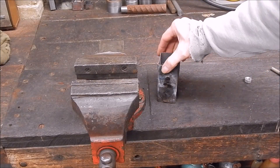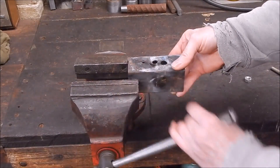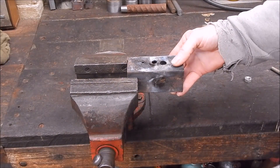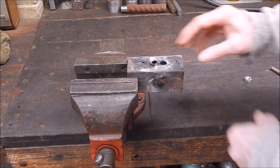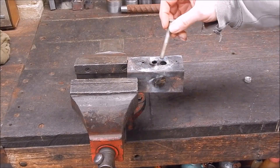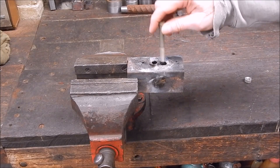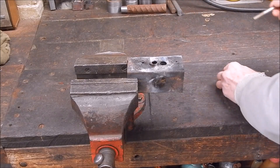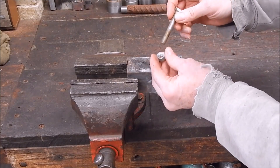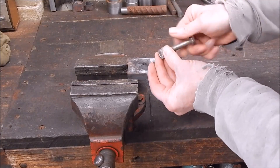When you do this sort of work you've got to conserve your heat energy as much as possible, so you isolate your work from any heat sink situations. I've just got a bit of old scrap - you can see it's well used - and we'll just mount the bolt down to one of these holes so we can come in on the back of the nut. So the nut goes on and we'll be welding on the back side.